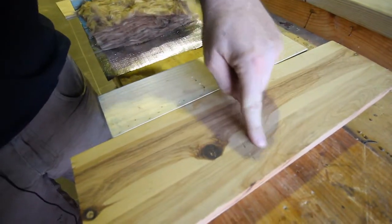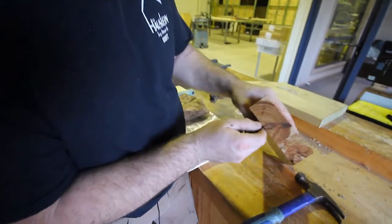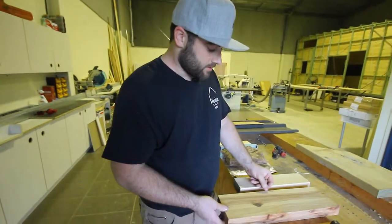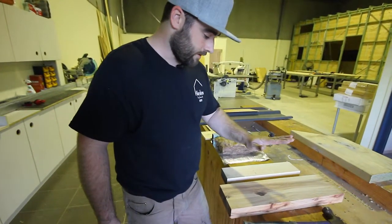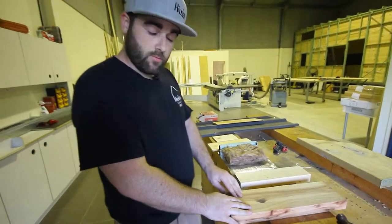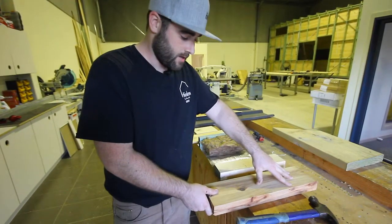Technically speaking it's a softwood, but in reality it's very hard — people refer to it as a hardwood. You can see there are lots and lots of rings, so a lot of age growth. It's a really nice timber not everyone has access to — such a nice slow-growing timber. Now cypress is a little bit weak when it comes to splitting — it splits very easily in that direction. However, that's not really a problem in the context we use it. We gain from the hardness, and it is a very strong and durable timber.